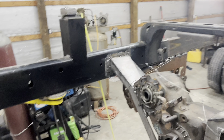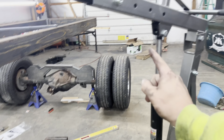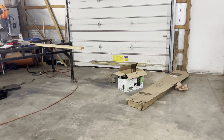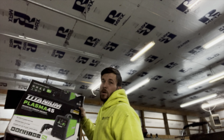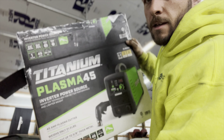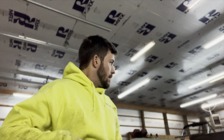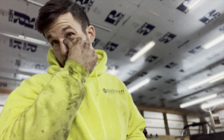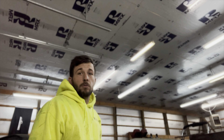Now that the transfer case is mocked up in place, I'm going to go ahead and start working on the front Super Duty axle — that'll be next. I'm going to get it chained up and dragged up here by the plasma cutter. By the way, the plasma cutter is doing freaking awesome — it's a Titanium or Hobart plasma cutter. It cuts through quarter-inch steel on 30 amps, I can move along pretty quick with little to no dross, and it's clean. Really a great investment.